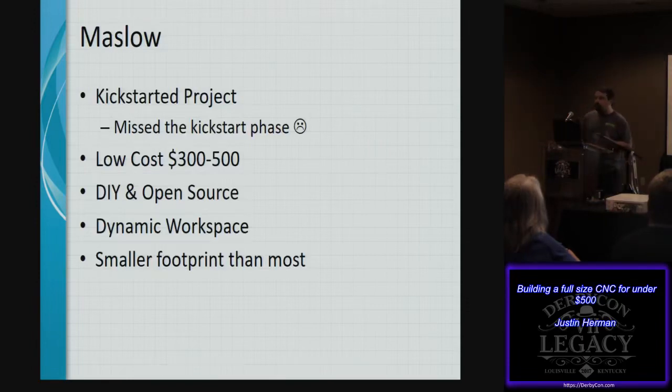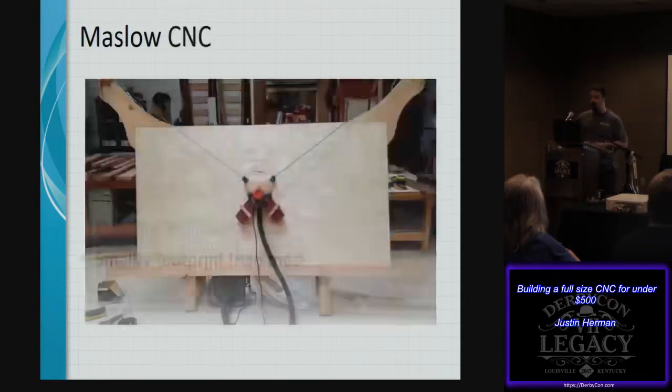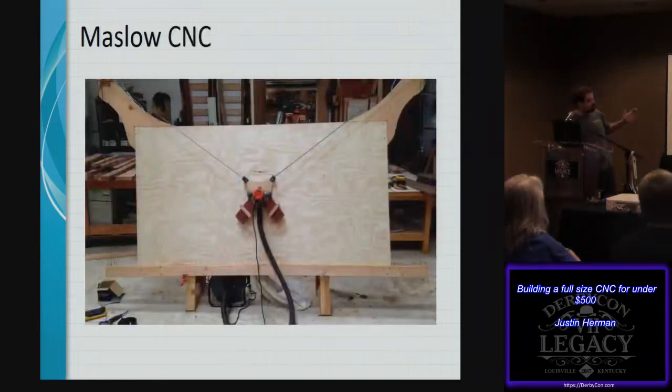And the interesting way that that was handled by one of the developers was to invert the workspace and set it on an angle. You do that, now you're using gravity to assist with your cutting mechanism. Your platen is pushed down on the work surface, and a couple of bricks or weights or whatever else you choose hold down that product, and chains, simple roller chains and motors, would take care of it and hold the router down to be able to cut most projects you're looking for.